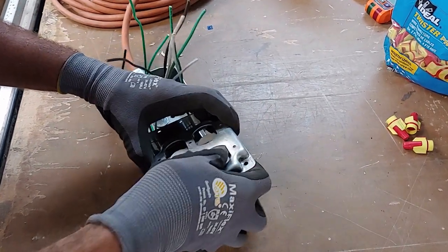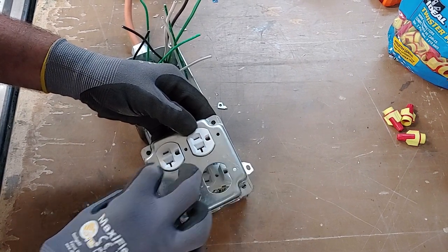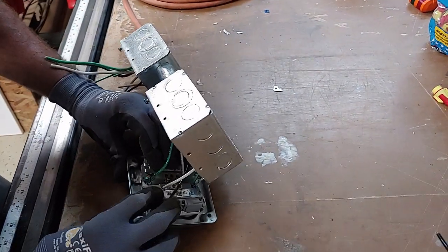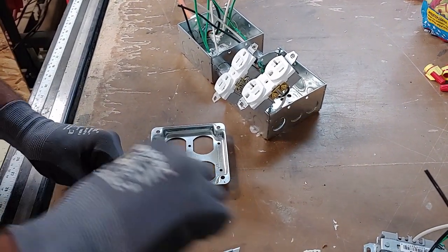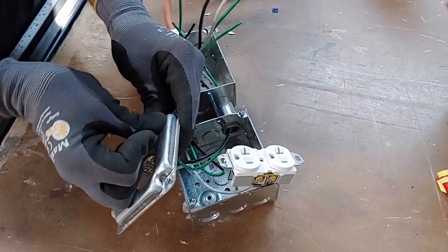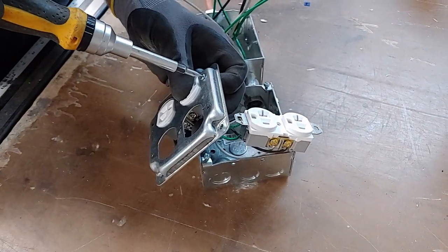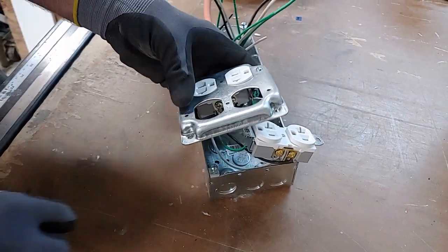The hardware they give us has two screws and two nuts per receptacle. Run the screw through the top holes — it's a little tricky getting the nut on the back, but it's good to hold it from the back side. Push the screw in from the front, hold your finger on the back of the nut and it should stay put, then tighten it down.